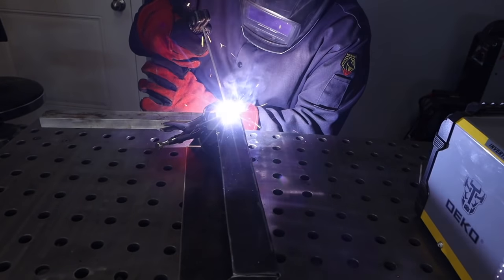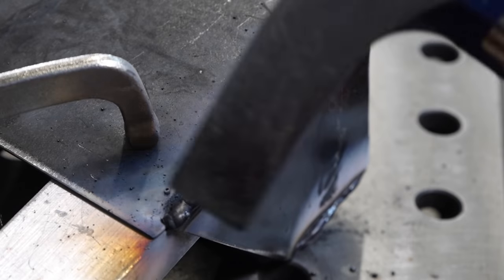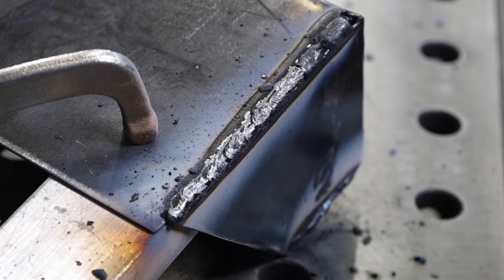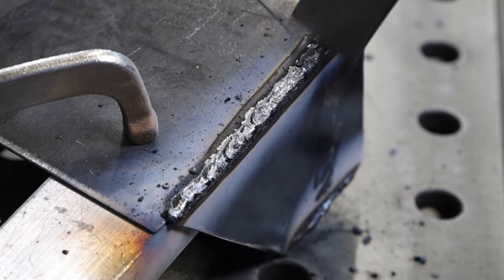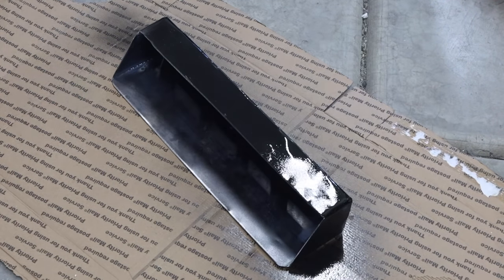As I weld up each of these corners, I'm moving along at a pretty good clip just to keep everything together, and it's actually going pretty nicely. Taking a look underneath the slag, the weld doesn't look too bad for a 6013 weld on the corner of some sheet metal using just about the cheapest welding machine you can pick up off Amazon — it shows what's possible. I'm going to clean it up a little bit with the grinder — you know what they say, grinder and paint makes me the welder I ain't — and then shoot a little bit of black on it and it'll be ready to go.